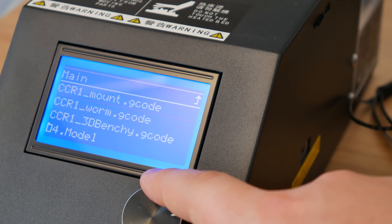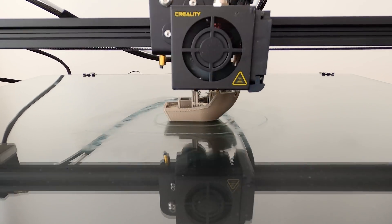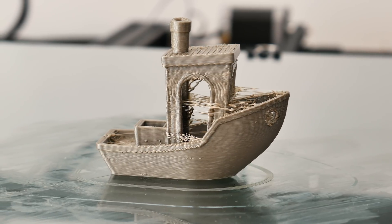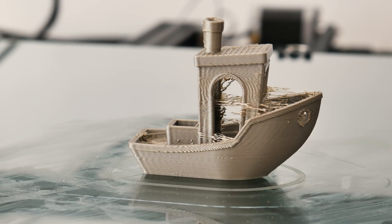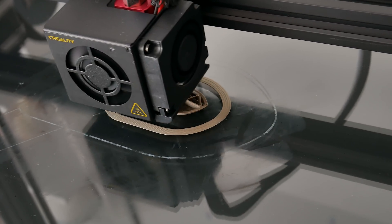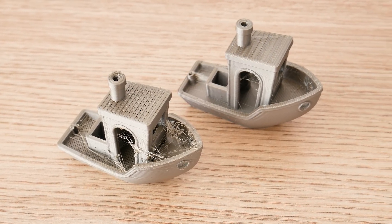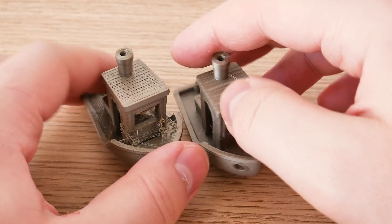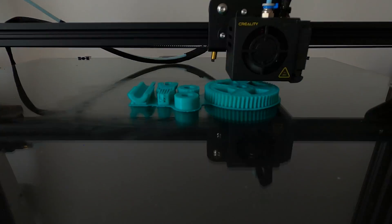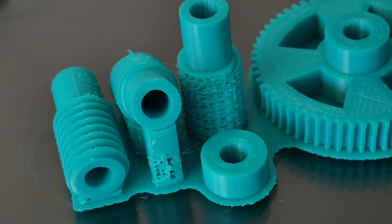Because this printer already has a 0.4mm nozzle installed, I start with that. The first print is a traditional Benchy boat. This turns out complete trash, but it's not the printer's fault — in the slicer I used 0.8mm nozzle settings for a 0.4mm nozzle accidentally. So my bad. I sliced it again with proper settings and now the result is way better. I still got some stringing, so I increased the retraction distance and speed for the next print. That print is PLA. Let's now try PETG — it usually strings pretty hard, but this print came out way better than the last one. Increasing the retraction settings helped, and this print is just perfect.